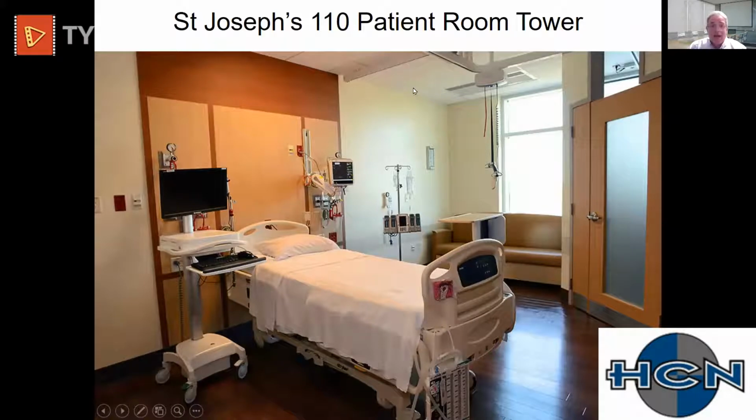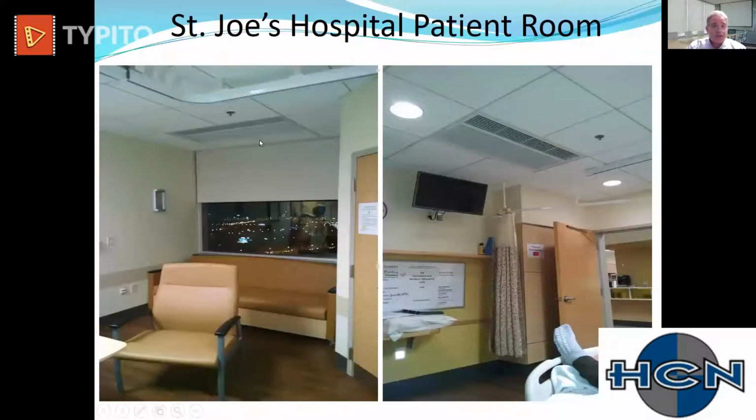Currently, I think I'm working on 5 VA hospital jobs. Most of the time now, they're using 2 one-way blow units in this kind of configuration because they would like to direct the breath or the exhaust off the patient to the exhaust in the building. So they have design strategies, usually where they set up the units perpendicularly. For instance, this is the same space. You have a unit blowing in the patient bed over here, and the other unit in the room, when you walk in, you're looking right here, it's blowing kind of towards over the patient. So they do have those in a perpendicular manner.